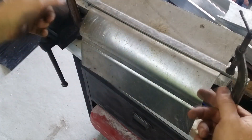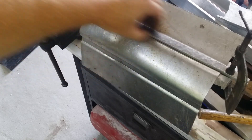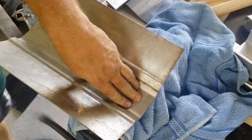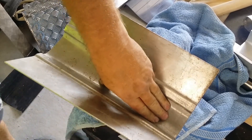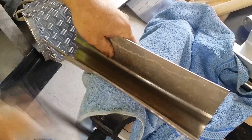The biggest trick with this piece is trying to get that curve in there without straightening the piece. So that's not too bad because it's held into place, but I've got to be careful that I don't open up that bit again. Now that I've got a couple of high spots to work off, I can put it in the vise with a towel to protect the metal and then start closing that up to get that curve.